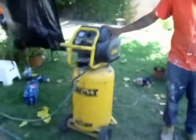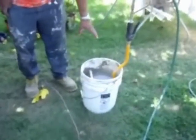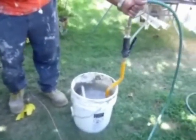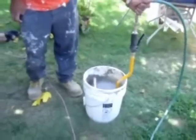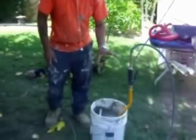To get it, we're gonna actually shoot the scratch using the Benron scoop and shoot, using our 15-gallon compressor. What I would really recommend you guys to do is provide yourselves with a bucket of water so that when you're not using your scoop and shoot, you can let it sit soaked in water so that the material doesn't dry in there, and it is easier for you to use it, and as well it keeps it clean. Okay?